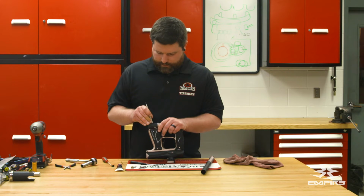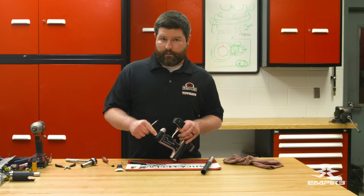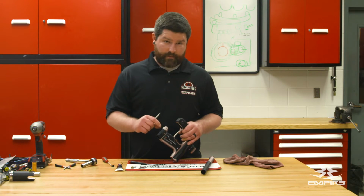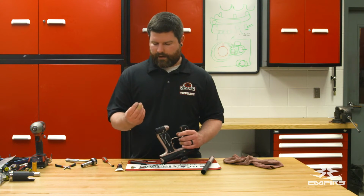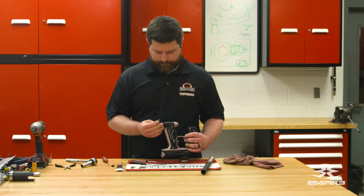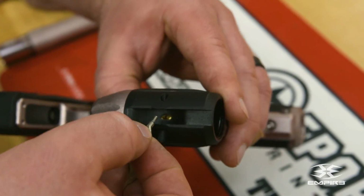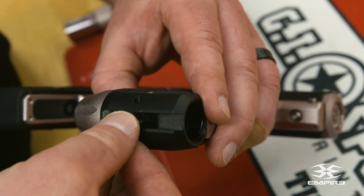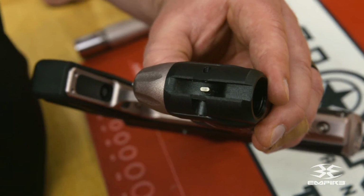And then I like to go in there and make sure that that pin that interacts with your tank is kind of pushed back towards the rear. That way you can fit your wedge and your spring in there, okay? So we're gonna go ahead, we're gonna drop that down into the slot, that oval slot in there, okay?